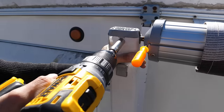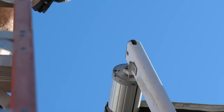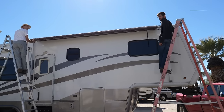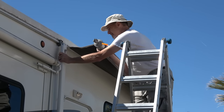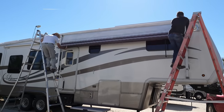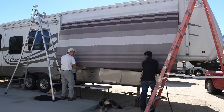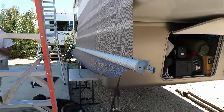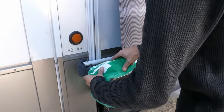Once the awning was pinned open, we used a drill to remove the bolts at each end of the roller tube that connect it to the awning arms. This is where two ladders and two people are required. Place ladders at either end of the awning, ensuring good footings. With one person at either end, we lifted the roller tube up and out of the awning arms and slowly unrolled the fabric while walking down the ladder. Once the tube was lifted, the arms were free to swing away — we pushed them back and latched them with the safety latch. Working on a calm day is very helpful here.